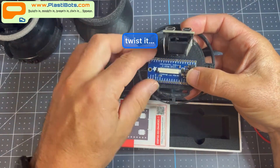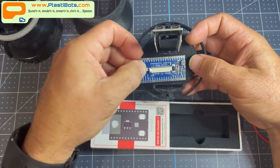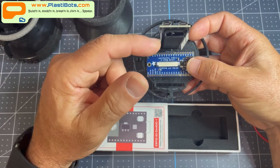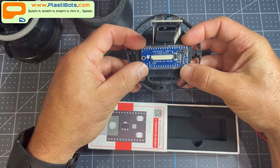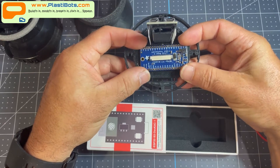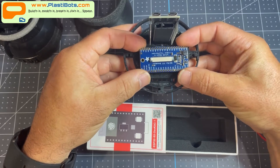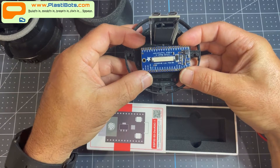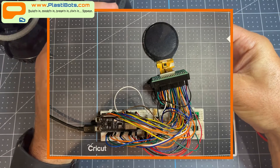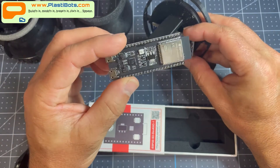The FPC connector board will slide in either flat or angled. I need to connect roughly 27 cable wires to the microcontroller, because the display is actually meant for HDMI connectivity and needs quite a bit to work with the ESP32. It uses an RGB and SPI interface, which requires about 27 connections — that's why I needed this large ESP32 unit with lots of pinouts.